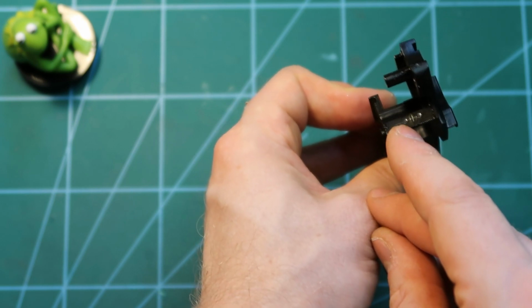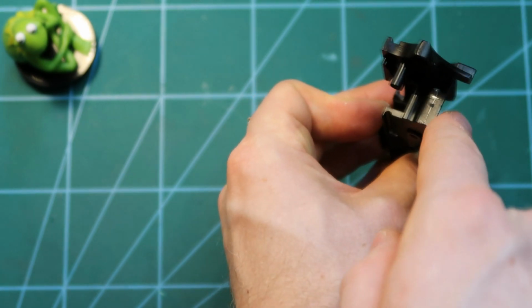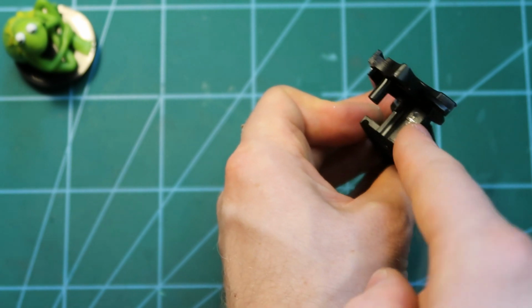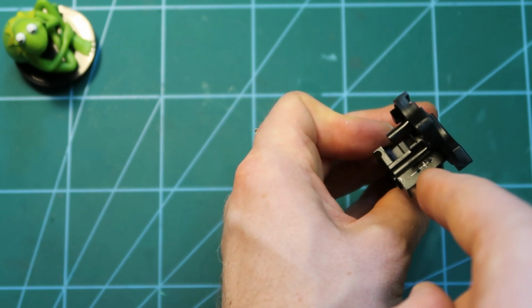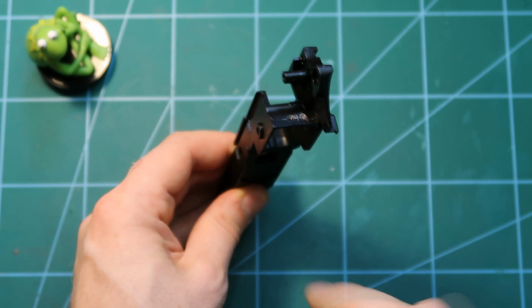So now when I will be drilling this one, that is a little moved to the side, I'll be drilling at an angle at first, and then I will switch to straight when the drill is in the center. Yeah, so I start like this, the tip of the drill will stand in place, I will slowly rotate it until it goes straight through. And the part is ready.